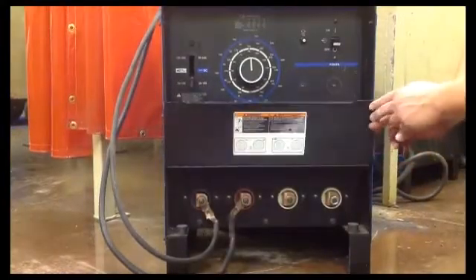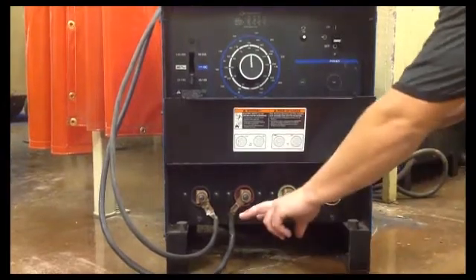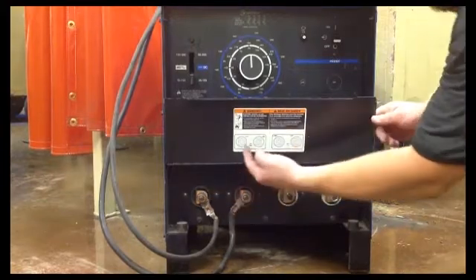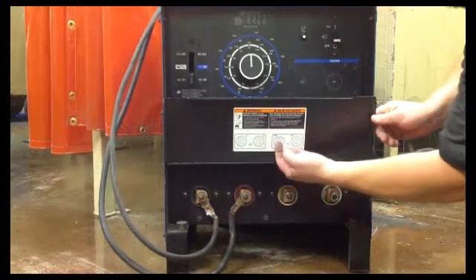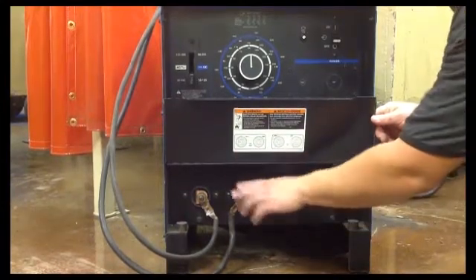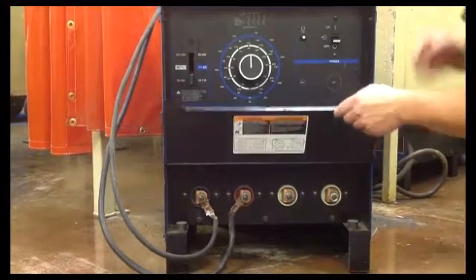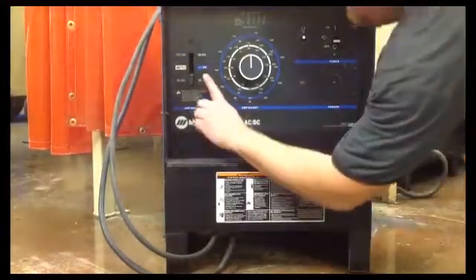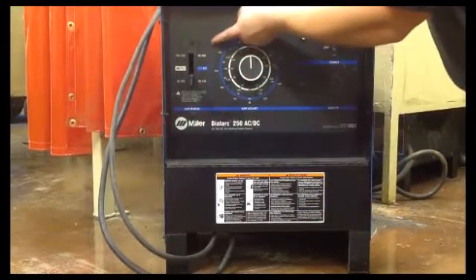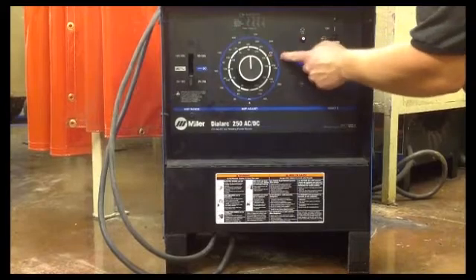Under the cover, we have your two polarities — positive and negative — along with polarity charts for positive and negative on DC. So you can see that we are set up on DC, so you're going to be using DC blue, 35 to 155 or 90 to 265, inside or outside the blue circle.